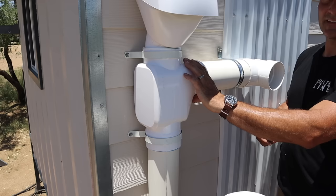A bit more explanation: the last piece I installed was a little conical insert. What it does is allow this ball — which sits in the lower portion of the first flush — to rise as the dirty water level rises, and then get stopped in there, essentially sealing off the dirty first-flush water from the clean water that will eventually route on to the tank. Now I'll add the lower portion and finish out this install.